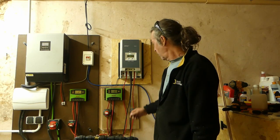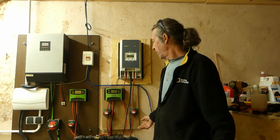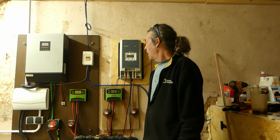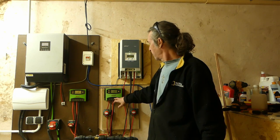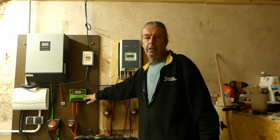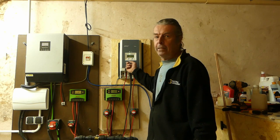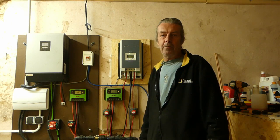Right, it's in — all wired up and the panels are connected. I can't show you any difference between the controllers right now because the batteries are fully charged. That one's pulling 200 watts, that one 300 watts, and this one 163 watts — they're all just ticking over in absorb phase. In the morning I'll do a comparison to see if this MPPT has lifted the PWM voltages. If the batteries are at 23 volts in the morning, the PWMs will only pull in at 23.2 volts, whereas if panel voltage is 38 volts, the MPPT should lead and lift them. Sorry — you'll have to wait for the next video for the comparison.